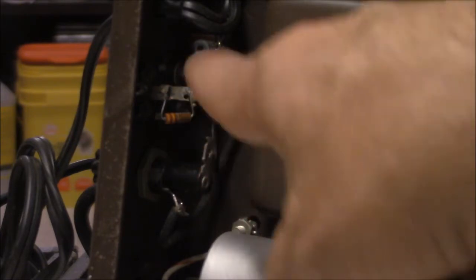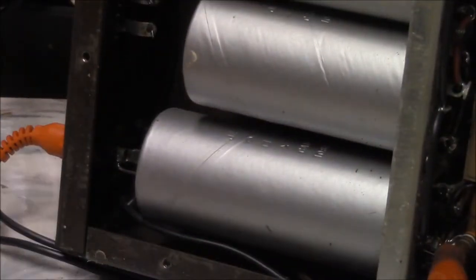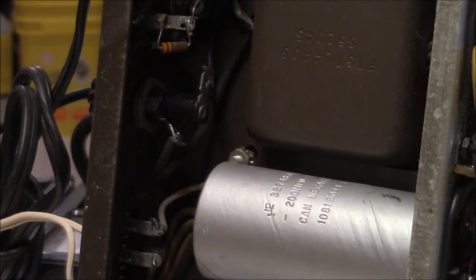This resistor assembly. Basically, the first thing you do is put a resistive load on the output side you're testing. Then you plug a jumper from here to the input. You can use an RCA cable. And it supplies AC voltage at 60 hertz, and then you're supposed to adjust the thing. I don't really like that. You know, this is the 21st century. Go get an oscilloscope and do it right.